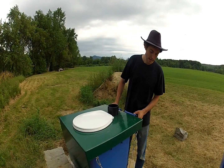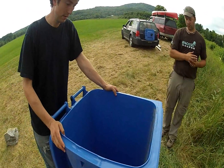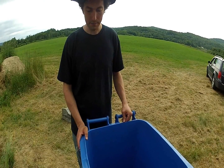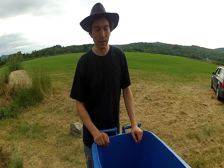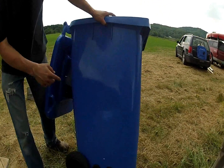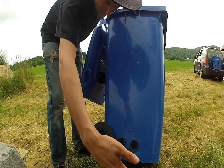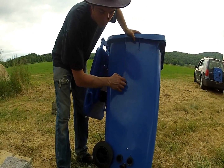If we look at this other bin, you can see what's inside — these two bins are identical; that one is underneath the green seat. In the bottom there's an elevated perforated floor held up by a sturdy grid a few inches off the bottom, so any excess liquid in the compost can drain through into the area underneath. That keeps the compost from getting too soggy — if it's too soggy, it won't compost properly. On the outside there are two air inlets on each side, so air can diffuse in from outside and work its way up through the entire compost.